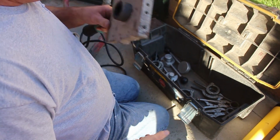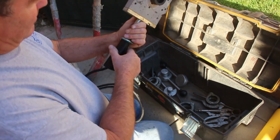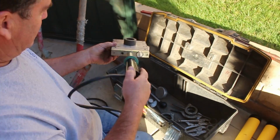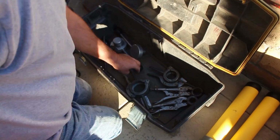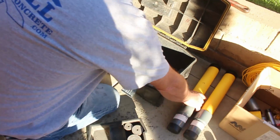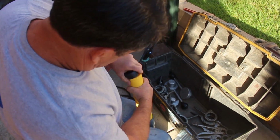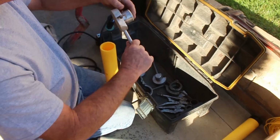That way everything's above. Now I got this tool I rented, and I noticed there was a lot of debris, old plastic that was melted onto these heat terminals. So I had to get it off because I want a nice clean joint. Now this tool here, something you put around the pipe, so when you're heating the pipe, your pipe stays round, because when it gets really hot it becomes real pliable. So this little clamp we're going to throw on there.